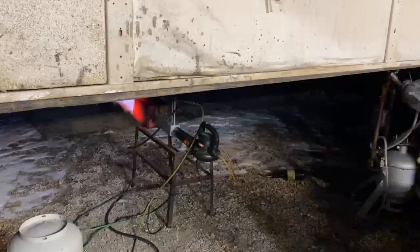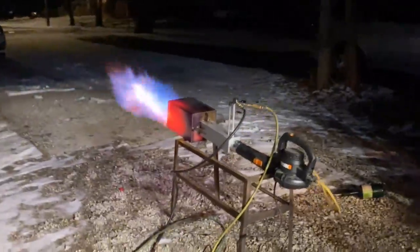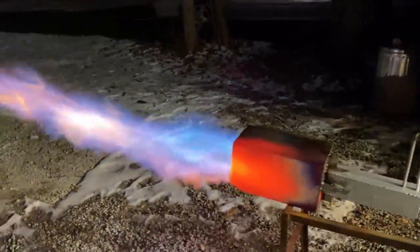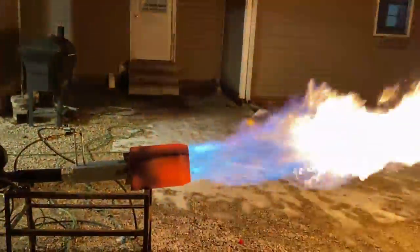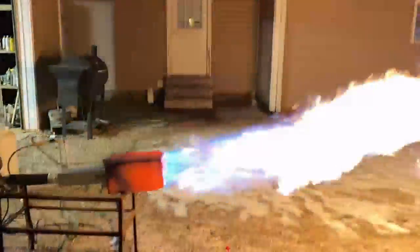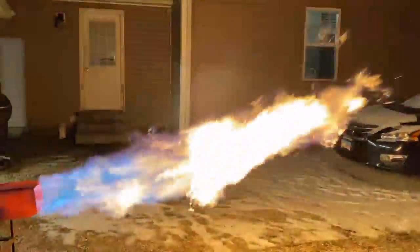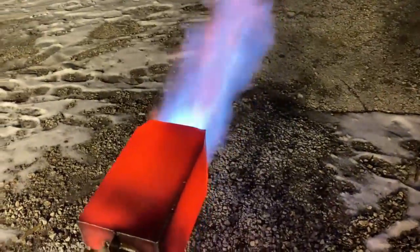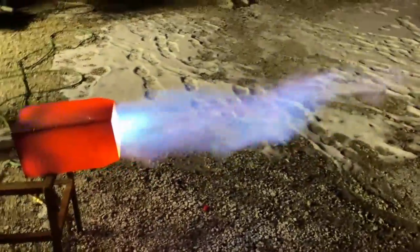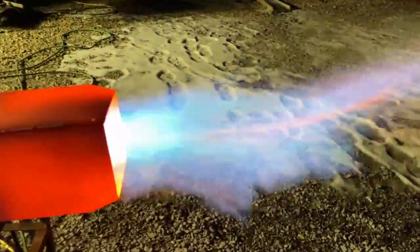So that's why I want to add this air blower. With the lights out you can see it does change the color a little bit. From experience, it's definitely a hotter flame. You see that little red spot we've got at the back of our firebox — the pre-burner? That means we're doing okay. This pre-burner is just a little bit too big, but the fact that it's all flowing red hot is pretty good. That means we're in there. We pretty much solved the problem.